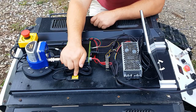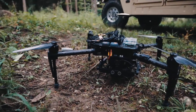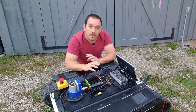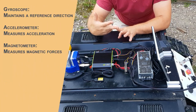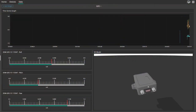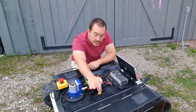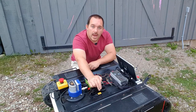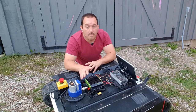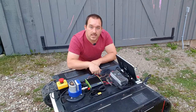The last thing we need is an IMU. If you're ever doing any sort of mobile robotics, I highly recommend something like this — it goes a really long way to measuring where the robot actually moves. It's a combination of a gyroscope, accelerometers, and a magnetometer, so using all that data it can get a really good estimate of where the robot's gone. This is a GX5 from MicroStrain, a really good IMU that does its own estimating internally to correct for any error. And of course, last thing, I just have a screen so I can try to figure out what this thing's thinking.